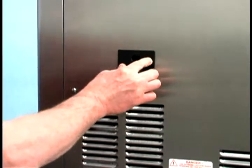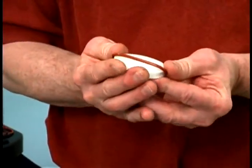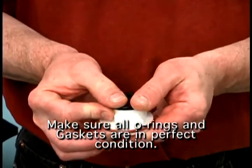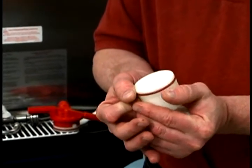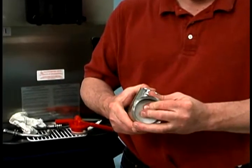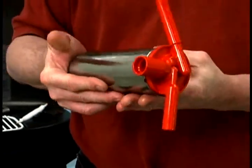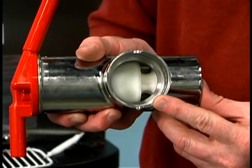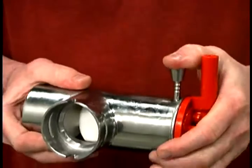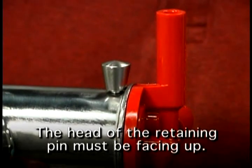Slide the longer drip pan into the hole in the side panel. Slide the shorter pump drip pan into the hole in the back panel. Slide the O-ring into the groove of the valve body cap. Slide the pump valve gasket into the holes on the cap. Insert the valve body cap into the hole in the mix inlet adapter. Slide the red O-ring into the groove of the piston. Lightly lubricate the inside of the pump cylinder at the bottom and then insert the piston into the bottom of the pump cylinder. Insert the mix inlet assembly into the pump cylinder. The drive hole in the mix inlet adapter must be visible through the drive hole opening in the pump cylinder, and the aligning notch located at the side of the adapter must be positioned into the notch at the bottom of the pump cylinder. Secure the pump parts into position by sliding the retaining pin through the cross holes at the bottom of the pump cylinder. For the pump to be correctly installed, the head of the retaining pin must be facing up.